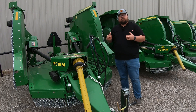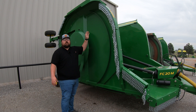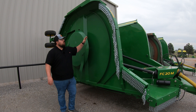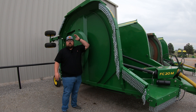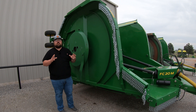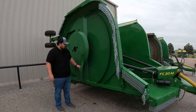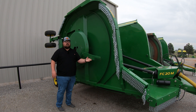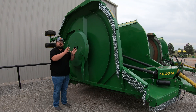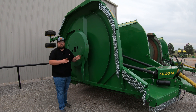So a lot more maintenance, a lot more moving parts — a lot more grease and things you need to check out — but you're going to have some of those same features like that heavy duty steel design and that double decker design to help with debris. We can go as small as a five-foot and as big as a 20-foot. Right here we have an FC20M, and I like to use these as an example to show exactly how big these are. I stand 5'10", 5'11" on a good day, so you can see just how massive these machines are. You can imagine you're definitely going to need some heavy duty horsepower, and you're going to have these massive blades with two free-swinging blades at each position, giving you six blades across one of these flex wing machines.